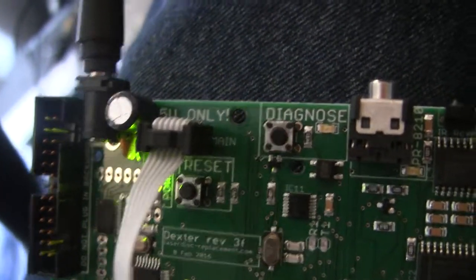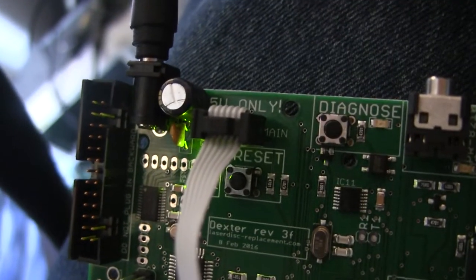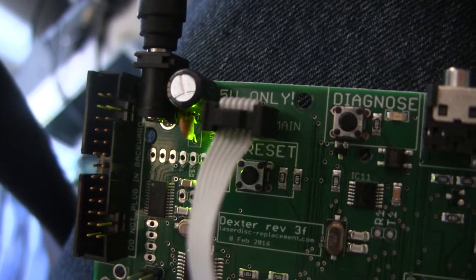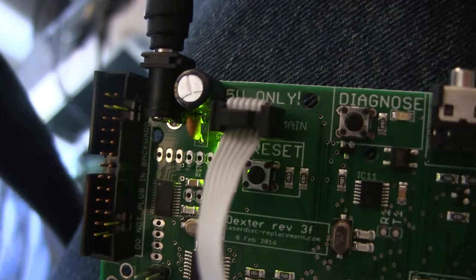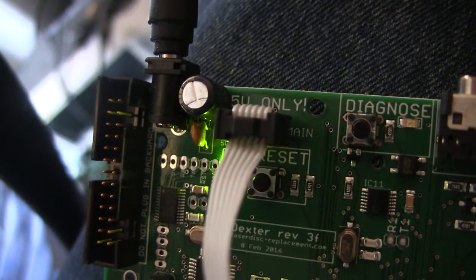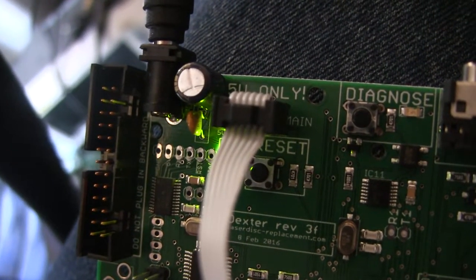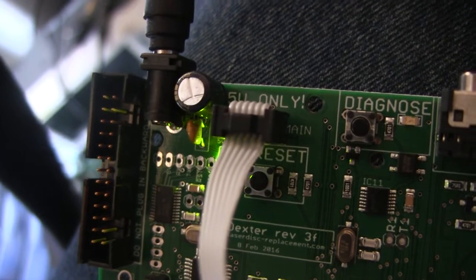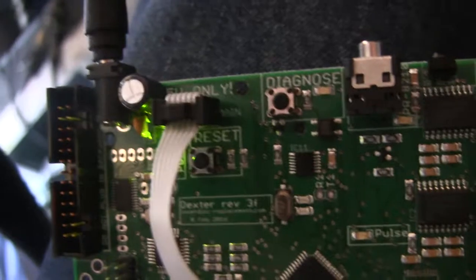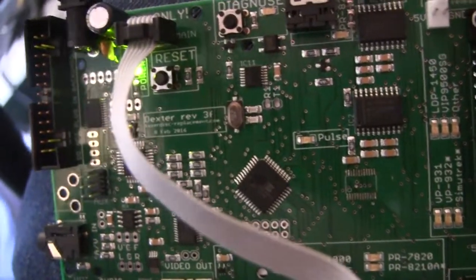I think my problem was I assumed that since it was professionally soldered there couldn't possibly be a mistake there, so I'm like, it can't be that. I was thinking it was more likely to be a bad component rather than a bad solder job, and that was my undoing. The fact that I got out the scope was maybe a little bit of overkill. I probably could have found this just by using the logic probe. So I probably didn't need to get out the scope, but I kind of wanted to see the voltage levels just in case. So I'm a little bit embarrassed at what the fix ended up being and how far off I was,